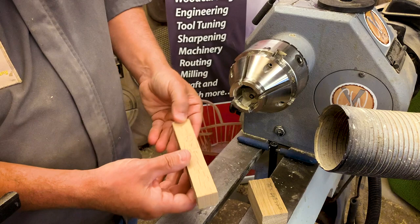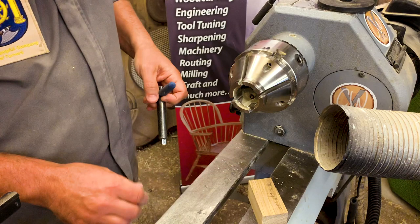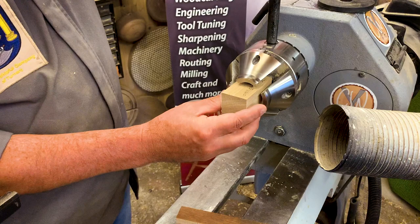I've got a set of OD112s in here. So the O'Donnell jaws, inch and a half OD, so the middle size. They can hold both of these for my drilling. What we're going to do, I'll do them both in the same way. Look, I can use the whole of the movement of the chuck. That will slot in there nicely, really well supported. Okay, nicely upright.